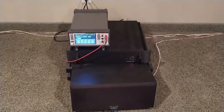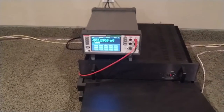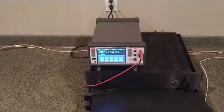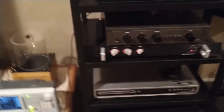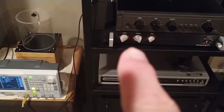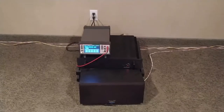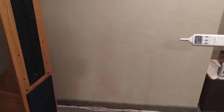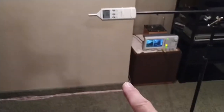I'm going to make a rough measurement for efficiency. I've got a multimeter down here that's going to measure the RMS volts out of the amplifier. There's a function generator over here generating one kilohertz, going into a little class A preamp, and the amplifier right down here is a class A single-ended amplifier rated for about 25 watts. I've got the sound level meter one meter to the center of this speaker — the distance from the center of the planar element to the floor is approximately one meter.